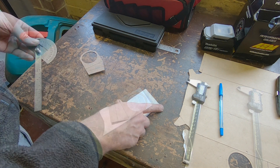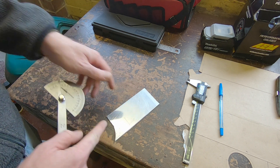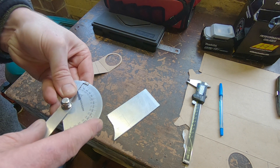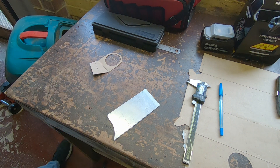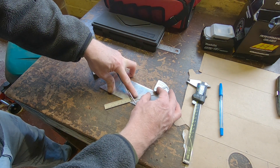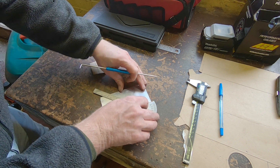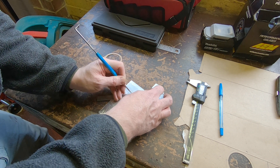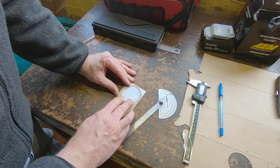Next up we've got to find our centre. Essentially you'll be trying to draw a square, so you just put a 45-degree line up in each corner and that gives you your centre. So set this at 45 and then get the scribe — top edge in the corner, 45 somewhere there, and go down that side 45-ish. That should be about our middle — not too bad.